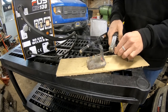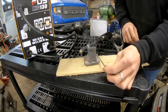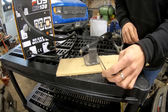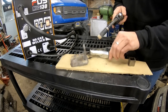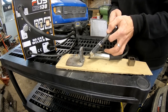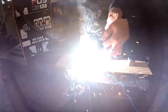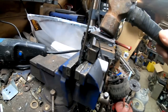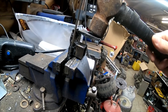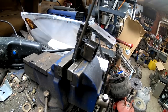The point of that was not to say it will do that thickness — the point is to show you that it obviously doesn't go all the way through; it only penetrates about an eighth of an inch, and you could smack that with a hammer and break it off. So we'll reground it, put another line on the other side to hold it, and smack it in a vise. We got it in the vise, gave it a wallop, and I'd say that's pretty conclusive — those welds held.